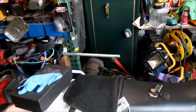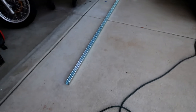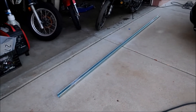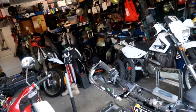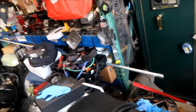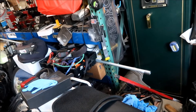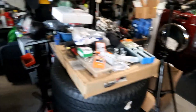I got the two super struts and the IMC — intermediate metal conduit — sitting right here. I don't think we'll need to cut it like last time; we'll just run it side by side with the conduit we ran before. I could reuse that conduit but we'd have to change to a bigger connector, so I think it's just better to run another pipe. I already bought it anyway.